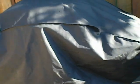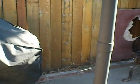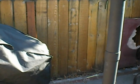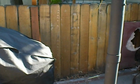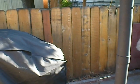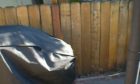How I got that: I think this comes with 4 pieces of pipe. I wanted 2 more, so I went to a muffler shop and was going to get 2 additional pieces. I wanted this taller. We have a 12 by 14 canvas wall tent we want to use this in. You need the top of your chimney at least 6 inches above the peak of your tent, so you don't get the sparks landing all over your canvas tent. Where I got that from is when I was in the muffler shop to get those 2 additional pieces, the muffler shop technician accidentally squished this one, and he made me the other one for free.